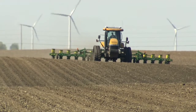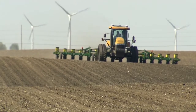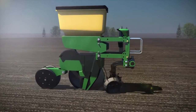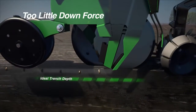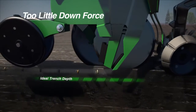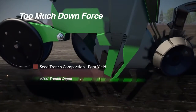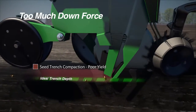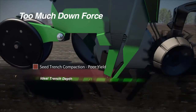The soil and terrain across your field can vary significantly. But when it's time to roll the planter through the field, properly controlling planter downforce is critical to your yield and your pocketbook. When a row unit applies too little downforce, the row unit tends to ride up leaving seeds planted too shallow — these may not even germinate. On the other hand, seeds planted with too much downforce can experience compaction that causes problems with root development, meaning lost yield potential.